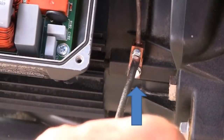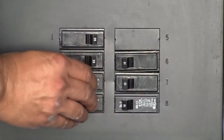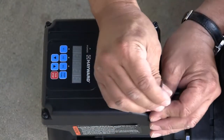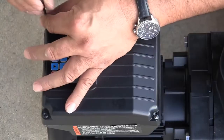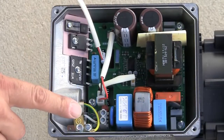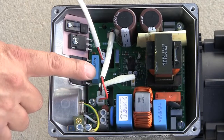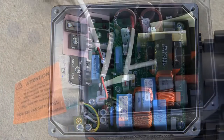Also ensure the pump is properly bonded and grounded for safety. To begin installation, turn off all electrical power at the circuit breaker. Next, remove the wiring access cover on the motor drive by removing the four screws on top of the cover using a 3 mm hex wrench. When the cover of the drive is removed, care should be taken to ensure no wiring strands or other debris are allowed to fall into the drive area or motor.